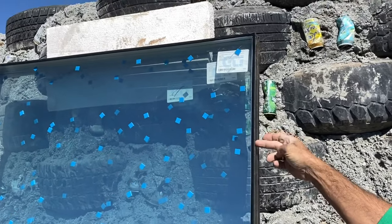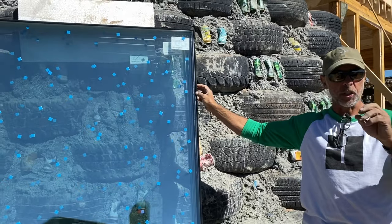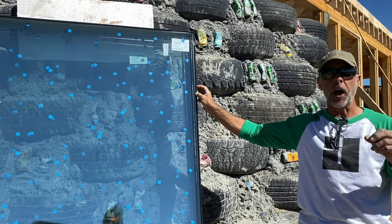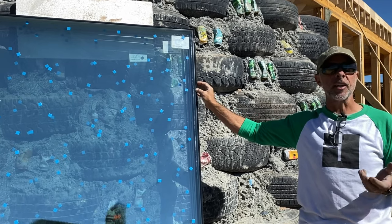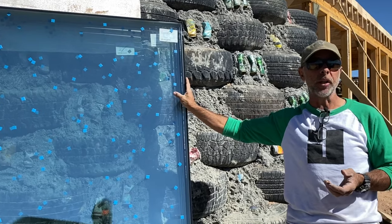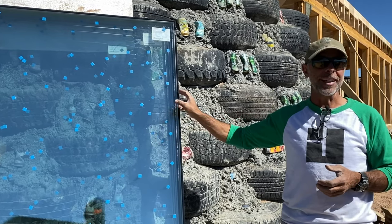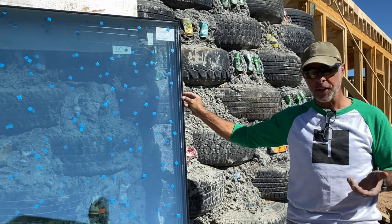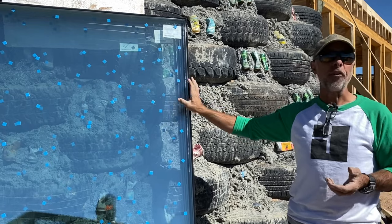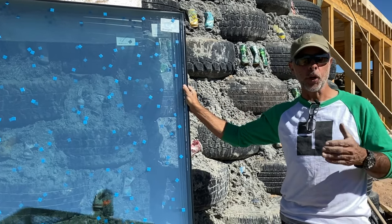So inside here are these little silica balls. It's nothing more than like those little sandbags you find in your leather cap or leather boot box. It's a condensation absorbing agent. And it's important that you get high quality windows, because over time, condensation will eventually wear out the desiccant inside of these spacers. If that happens, say in about 10 years, this is going to fog. It doesn't hurt passive solar, but it will hurt your view.